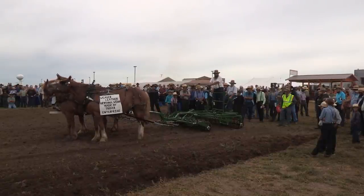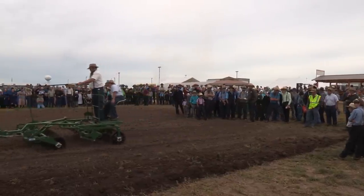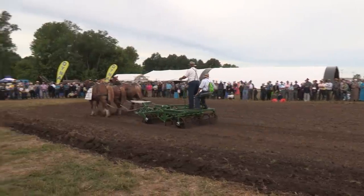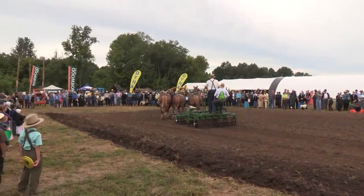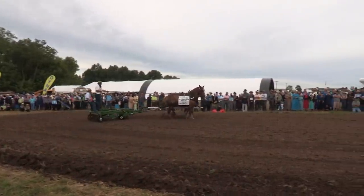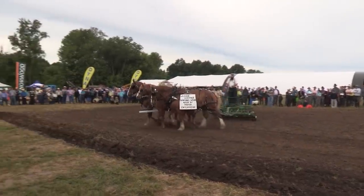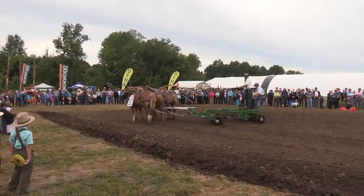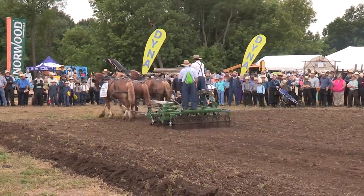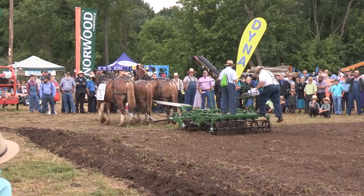Coming up, we have a six-foot roller mulcher from Pioneer Equipment. They also have six-foot, eight-foot, or ten-foot models available. A unique feature of these roller mulchers is that they save trips across the field. It also has a swivel in the front to turn on the end so it doesn't drag. There's a tongue provided so that when you come out onto the stone drive or up by buildings on a hill, the roller mulcher doesn't run into the horses. Tines raise and lower vertically instead of in a circular motion for accurate performance at any depth.